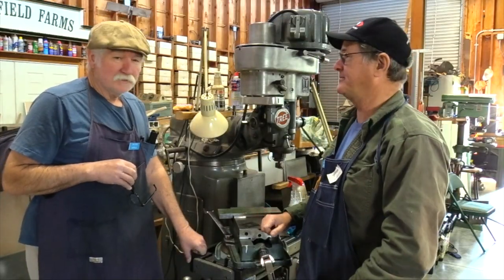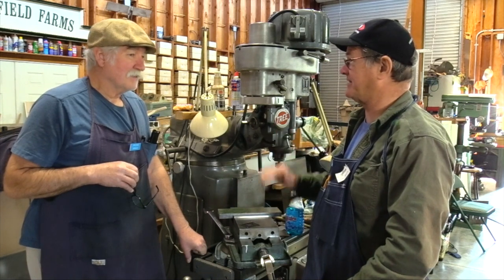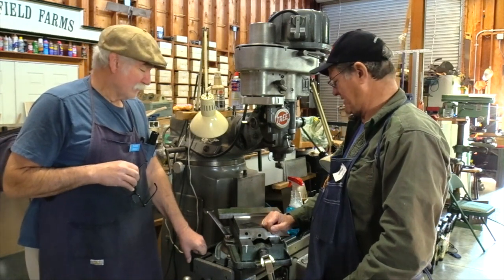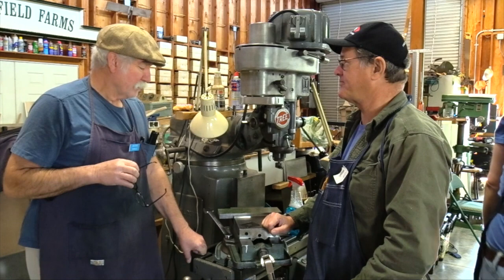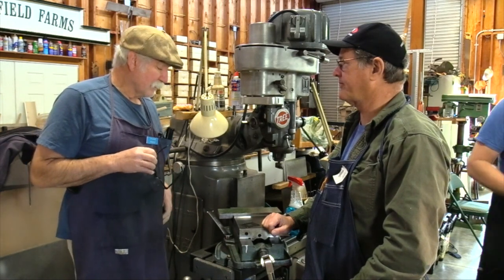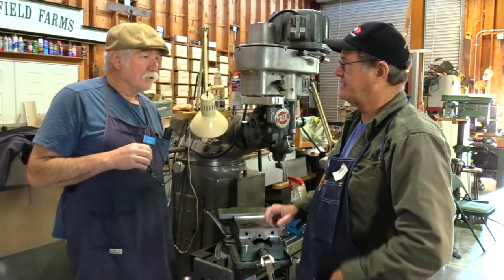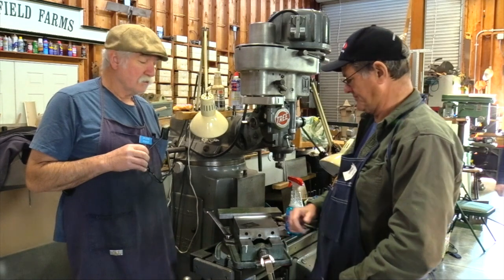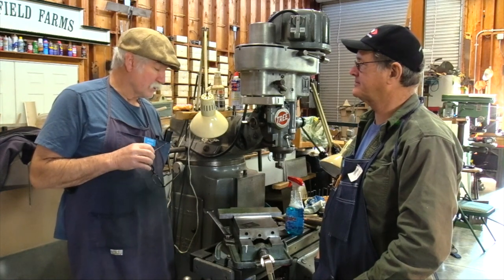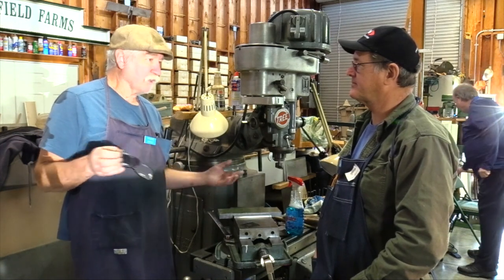All right, this is our host, Jim, and Jim has been scraping on this bar for 5 days now. 4 and a couple hours. So how's it become intimate with that? How's it coming? It's been a little bit frustrating, but I've learned a lot. I think I've struggled the last couple of days. I've learned that I was probably not taking my prints very consistently. Doing the rubbings, we're just kind of all over the board. I started having weird readings, and I make a rubbing, immediately wipe it clean and do another one. I get a completely different reading.